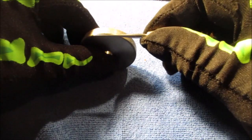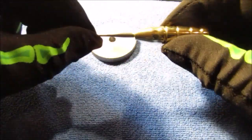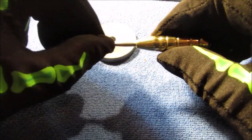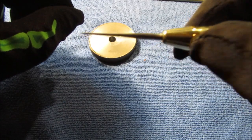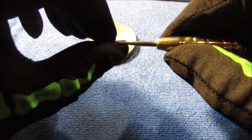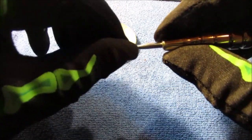And to lay this up on here and make this tapered was not very easy, because I had to have my fingers way out here, and I had a can of water. Every time I got out, I dipped it. I didn't want to lose the temper or the strength of this. This is a high-speed steel drill bit. A shiny silver one, I know for a fact it's a high-speed steel drill bit. It was actually a brand new bit, but I sacrificed it because it had been chewed up in a chuck. The cutting edge is brand new, but it slipped one time in something.